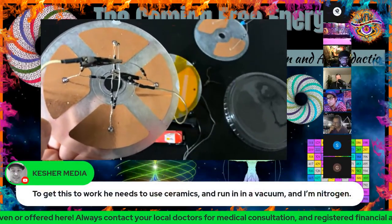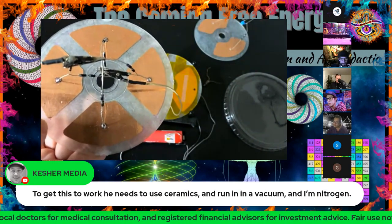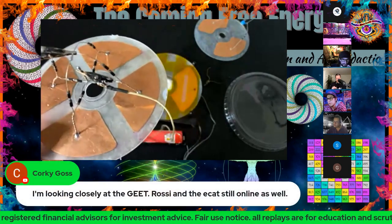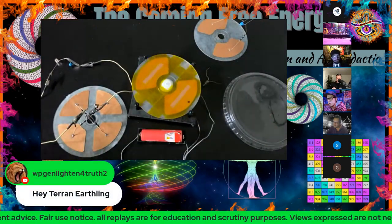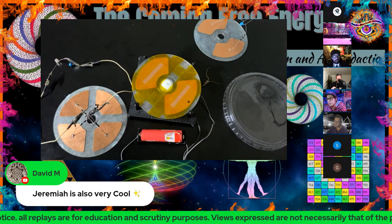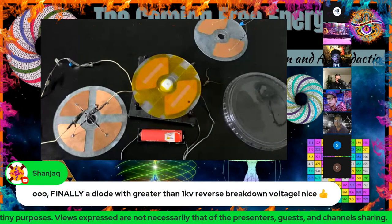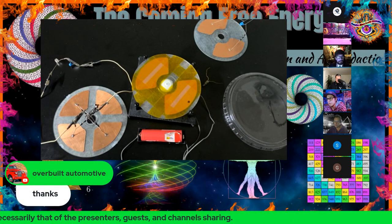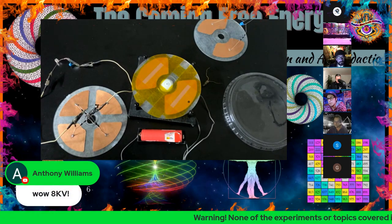They are incredible. I've operated a specific offset of the 2CL series up to 2 megahertz, and they will still operate. They're not rated there. You look at the data sheet, and it's extremely simplified. It's like a one or two-page data sheet, depending on which one you're looking at. It doesn't list these characteristics, but they happen to be accidentally incredibly fast. So I've ordered them in droves and used them for all kinds of experiments, and actually replace voltage multipliers in circuits where there's a Tesla coil present, because I can rectify the Tesla coil directly with these things.